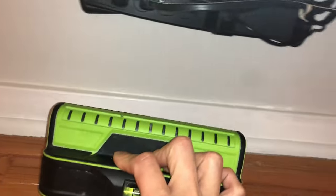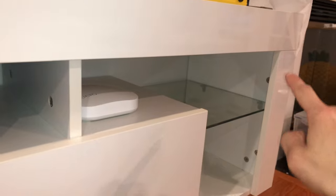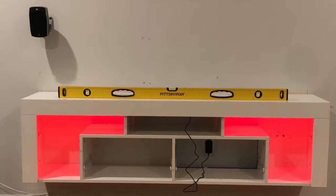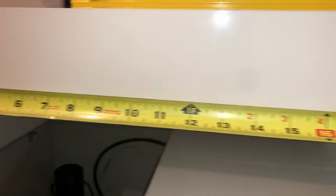Given the length of this stand, you should be able to hit a stud or two behind the wall. However, the problem is the stand only mounts in four predetermined locations with the provided brackets and clip holders. This may place the stand in a less than desirable location in your room. You must get your measurements exactly right, or else you won't even be able to get the stand onto the wall. Also note, the mounting locations do not follow the standard 16-inch or 24-inch on-center stud spacing found in most homes. Be prepared for the possibility of having to open the walls up and adding some horizontal blocking in order to get the stand exactly where you want it to be.